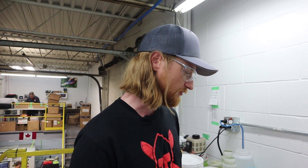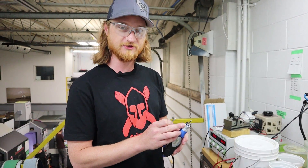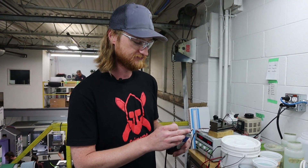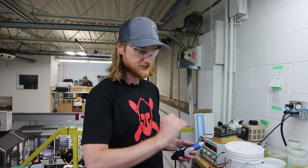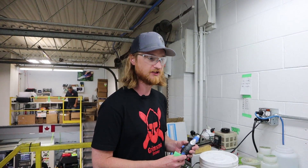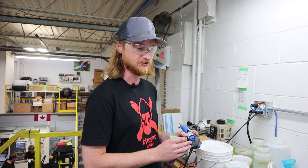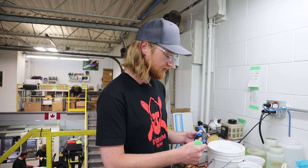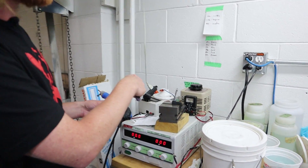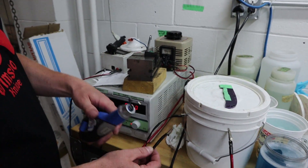It's way stronger than traditional steel. With that, we're able to put it into an engraver like this — just a regular electric engraver with a piece of broken old end mill in the front. You apply electricity to it and it electrically transfers the carbide onto the handle. You can get these from Princess Auto, Canadian Tire, KBC Tools, or Harbor Freight. We don't use any special carbonizing unit — this works just fine. You also need a power supply, and that's the trickier part. This is our old anodizing setup, which lets us apply negative power to the part and positive power to the engraver.